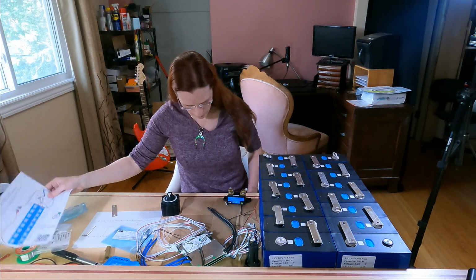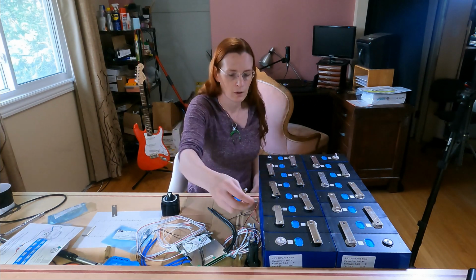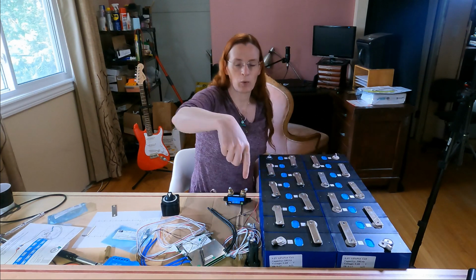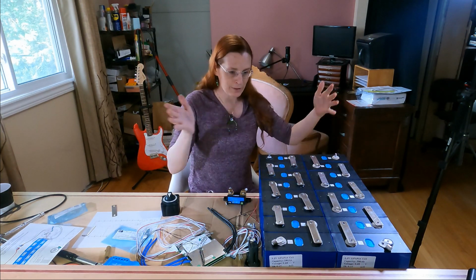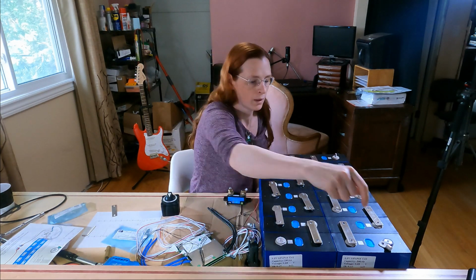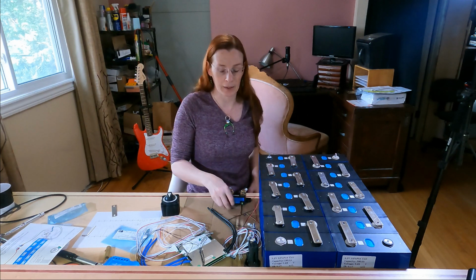And so for that, what I'm going to do is take a couple of these ring terminals. I'm going to put one here, and there'll be a wire between them. And that'll connect the two 24 packs in series into a single 48 volt pack. Now, I am going to pause here and get these off before I make a mistake.